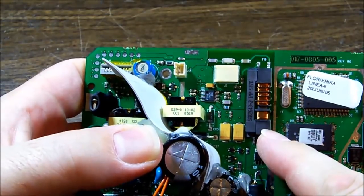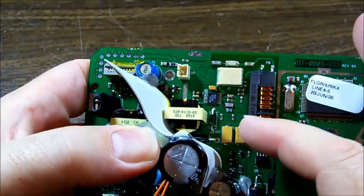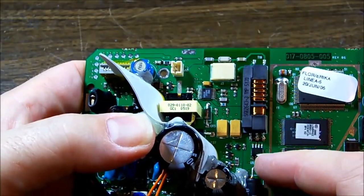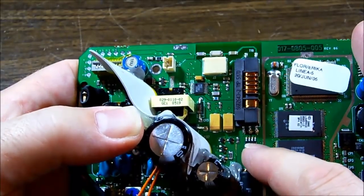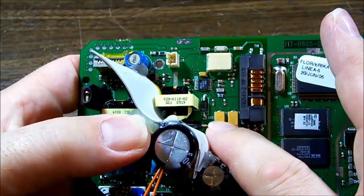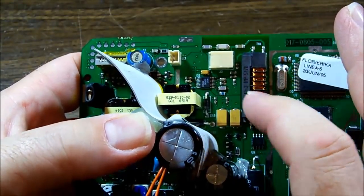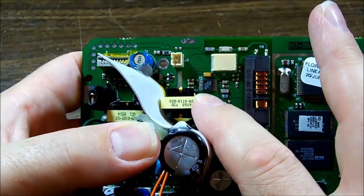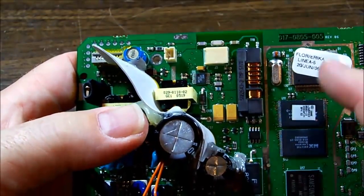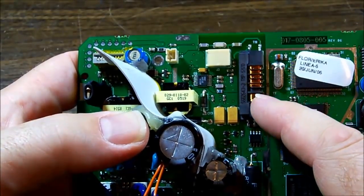But I thought I'd just look at it a bit closer and think about the vicinity of everything. And what I'm thinking is this is the backlight power supply. So here's the step-up transformer, and this looks like a FET that's switching across the primary of that. There's a couple of capacitors there, and it's all in the vicinity of this, which I think is taking 12 volts, stepping it up through here to maybe double, or what have you, which then allows this to generate an even higher voltage across here.